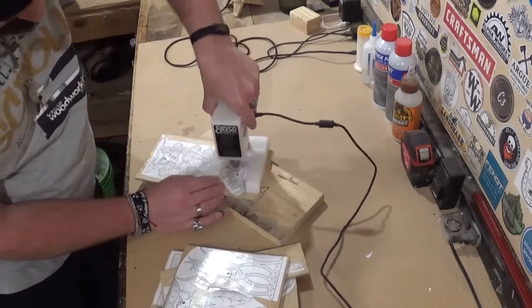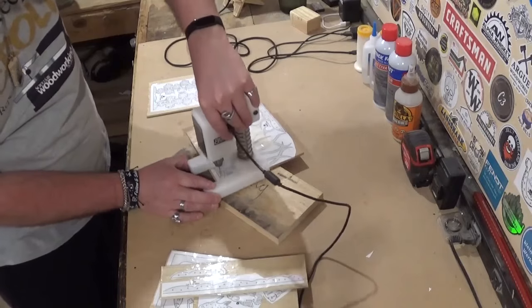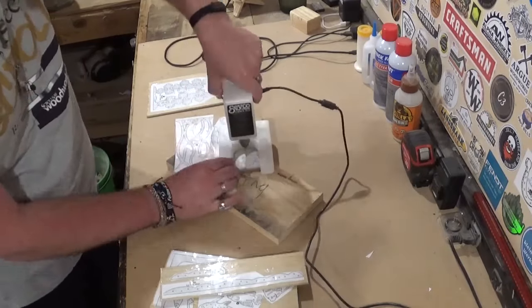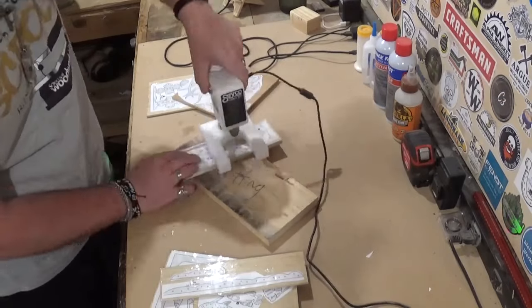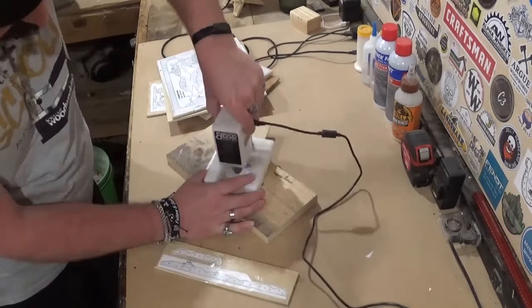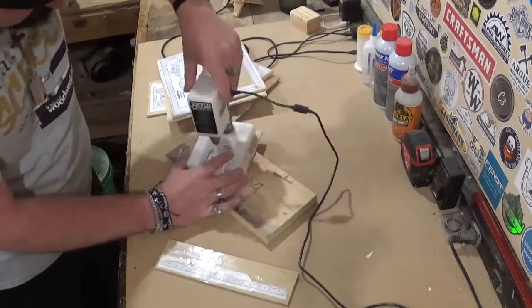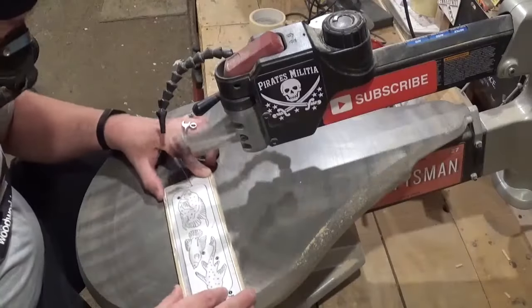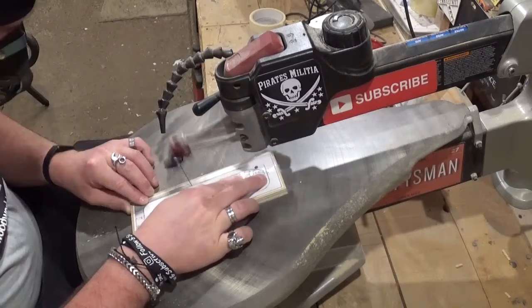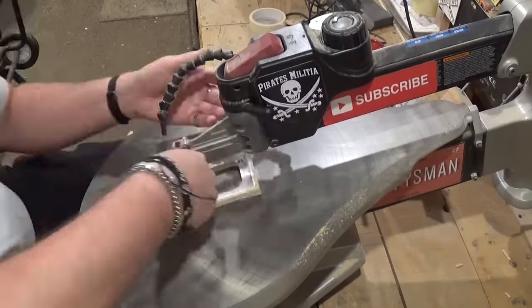Over here on the workbench, we're taking the Dremel drill and drilling out all of the pilot holes for internal cutting. You'll note that I have a backer board behind the scroll work to prevent blowout of the pilot holes on the reverse side. There are several interior cuts on this project, but as always we'll take our time. Once all of the pilot holes are drilled we'll head over to the scroll saw and begin scrolling — I will begin by cutting out the frame of the aquarium.